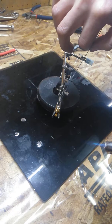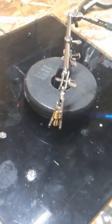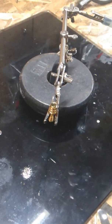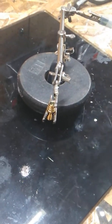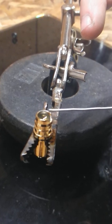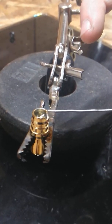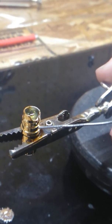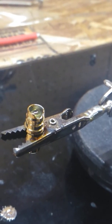Right now he's filling the cup with solder. You don't want to get solder on the outside if you can help it, so don't overfill. See this little divot right here? You don't want to fill solder at the top of this divot — only fill it just below that. Try not to get it on the outside or it'll be a real pain to clip into the connector.